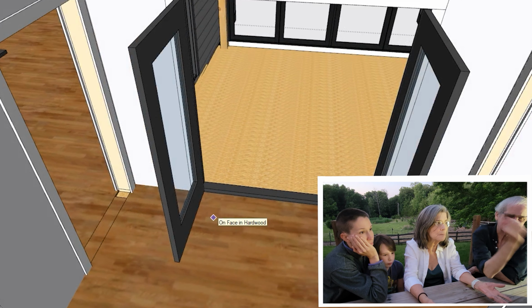All right, so what can I do to stay ahead of you? I'll quit right here and start parging, because it takes me a while. If you start parging the wall, then we can start working on the waterproofing and get ready for backfill. The inspector wants waterproofing in, gravel and drain pipe to do the backfill inspection. So if we can get that parge done, then I can backfill next week.